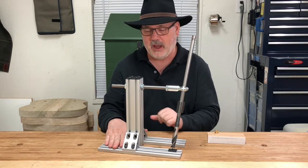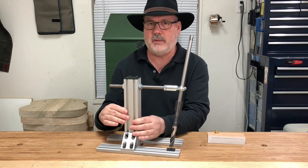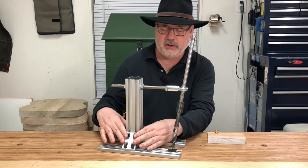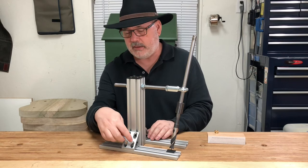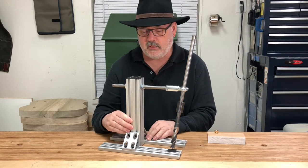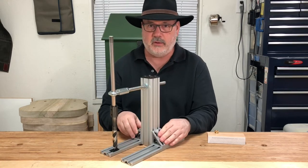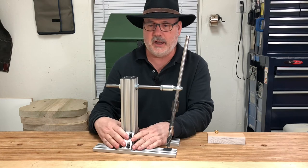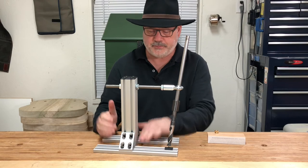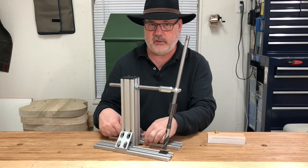Nothing changes there. The tower is basically a two-inch by two-inch tower attached to these runners via gusseted brackets. These brackets have four screws going into the runner and four going into the tower unit on each side — a total of 16 connection points, which makes this extremely rigid and secure. The runners are two inches apart, just like the wooden version.